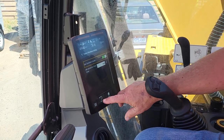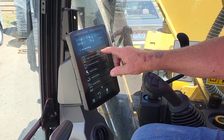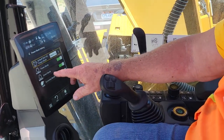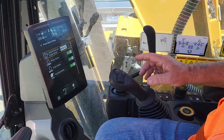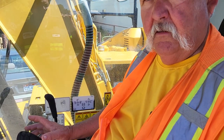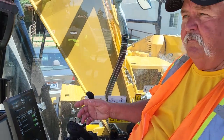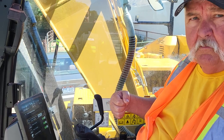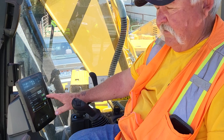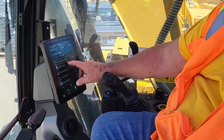So it's idle. I'm going to go back out of that one — that was engine. Power mode: as long as you see power up on top, we're good. You have a smart mode on this. What smart mode does is if you get real easy digging, you can turn smart mode on and it'll be like economy mode. But then if it detects you need all the power, as long as you've got power up here, you're good. I'm going to turn economy right off because these two work good together.